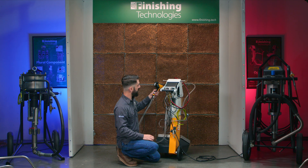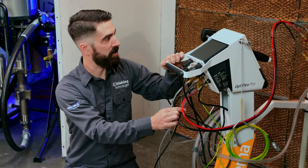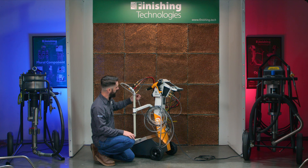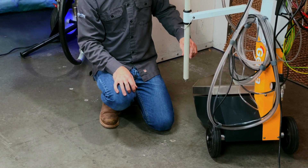The next airline is going to be your fluidizing air line — that's the six millimeter black line coming out of the back of the control unit. That airline sends fluidizing air to your pickup tube assembly through a restrictor, through your pickup tube, and through a fluidizing ring at the base of the pickup tube.